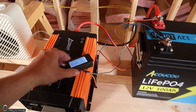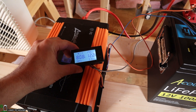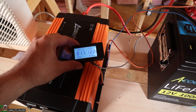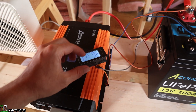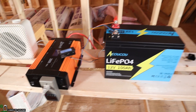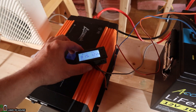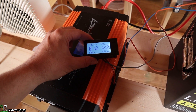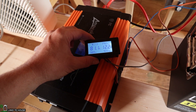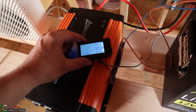At 55 minutes in we have 916 watt hours used. We're at 29.8 amp hours left. Battery is at 12.2 volts — of course, that value is with a load, and as soon as I pull the load off it will jump back up to a reasonable level. Still pulling approximately 80 amps, with 980 to 990 watts on the consumption for this load. I'll bring you back whenever the amp hours get down to zero and we will see what our watt hours are and what the time is.